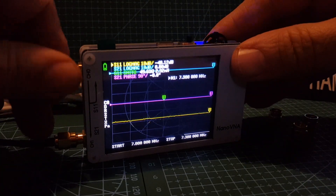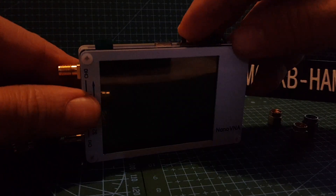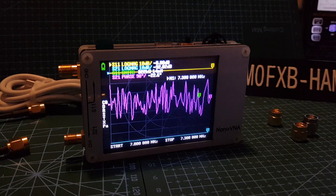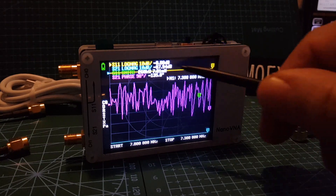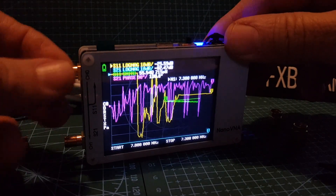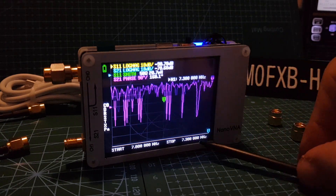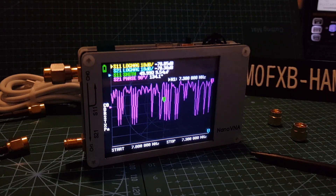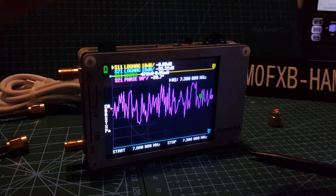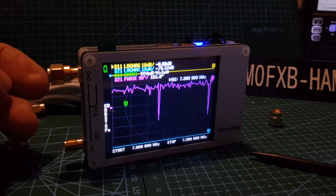Let's take off what's here and turn it off and back on to reset it. Now we've got this pointer here showing where the circle should be. We'll screw on the load and it should go really to the center — if it's in the center, you've calibrated correctly. Then put on the short — that should bring it straight across to the other side, which is a good way of checking the calibration.